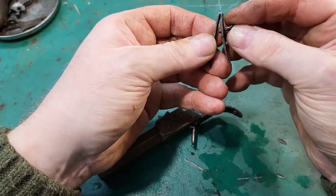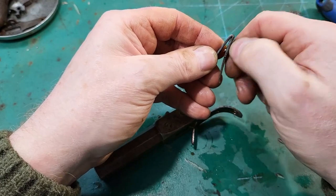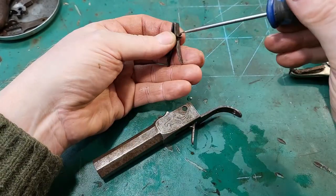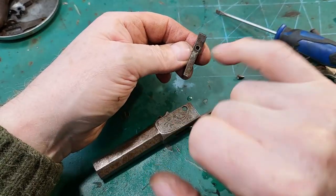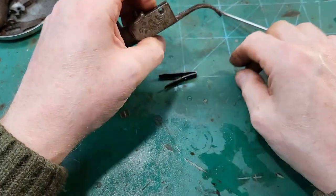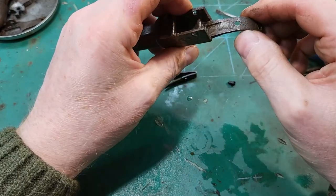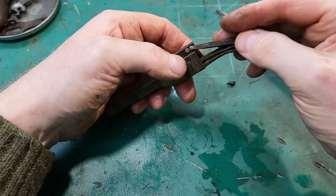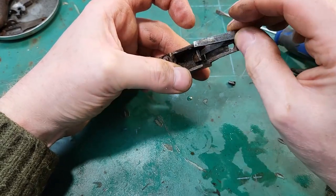This screw setup's not brilliant, is it? It's loose in there. What I think I'd do on this is re-tap that, put a new screw in there, maybe try and slip a nut in as well and loctite it. Because once it comes loose, that allows the bottom bit of the spring to rise up and then it can wander around in there.